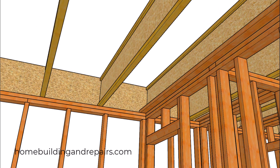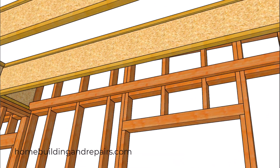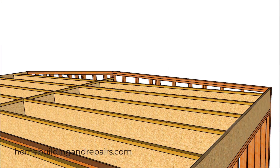The truss joists are 24 inches on center and this ceiling backing can nail into the wall framing studs. The fire blocking is to prevent air or fire from passing through the wall framing and into the ceiling. You might be thinking — what's going to prevent it from going right through the drywall into the ceiling? This is just another safety precaution in case it goes through the wall framing rather than the ceiling.